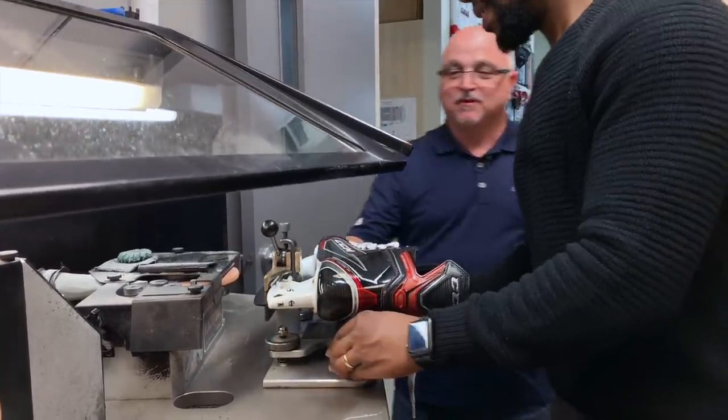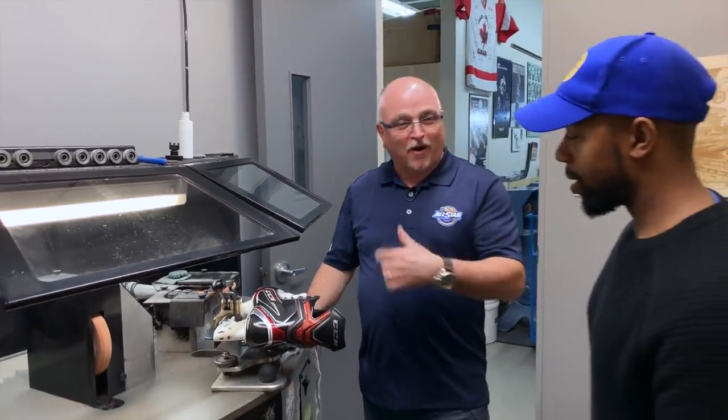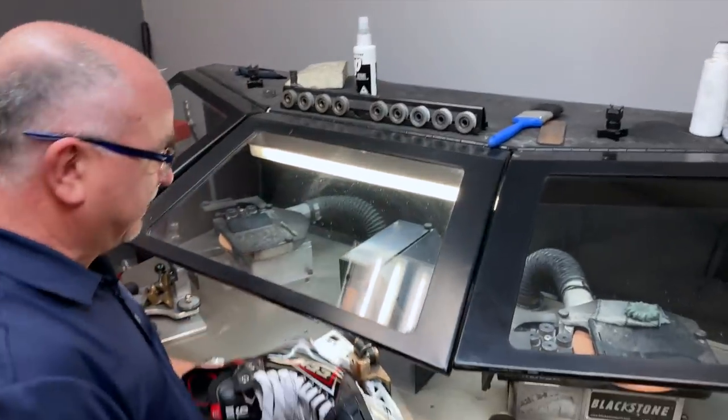Okay, we're going to put the machine on and start with a cross grind. I'll do the first two passes and then let you do it. Depending on how new the blades are, it should take about five to seven passes to get it square. I'll show you and then get you on the machine to finish. Always want to hit the center of the blade.